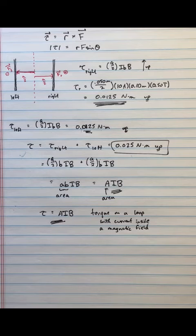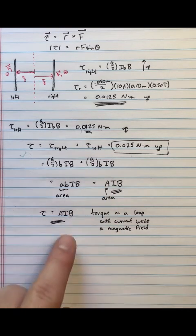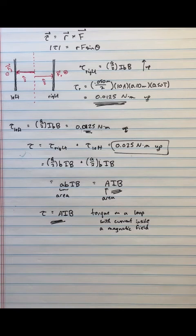And it turns out you need a device called a commutator. A commutator allows you to flip the direction of the current to match the spinning of the loop of wire in order to keep it going in one direction. Without me being able to draw that on the screen here, I'm not going to try that. Simply say that what we're showing here is just the starting point for actually building a working electric motor. But with that being said, these are the basics.